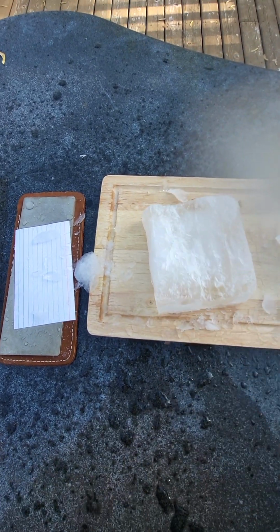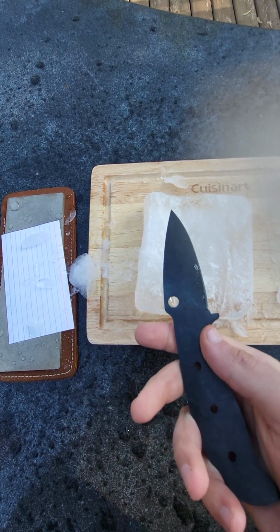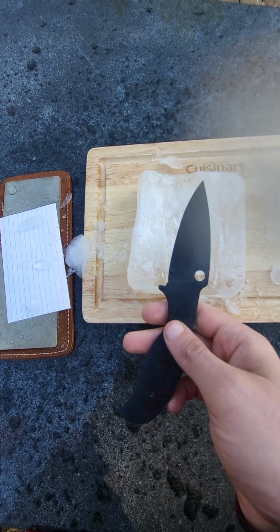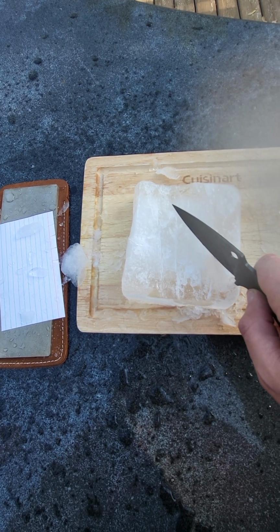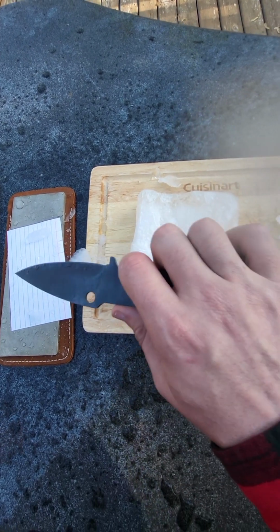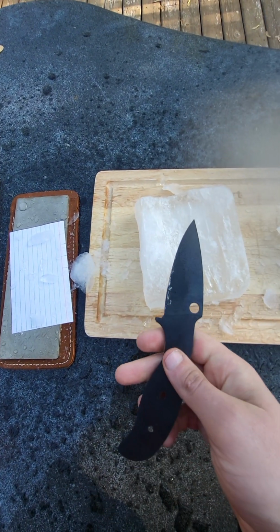Now, like I said, this knife was dull, or dull to testing standards. So right now I'm just trying to actually beat this up a little bit. Then I could go to something harder. I got plenty of rock that I could actually hit it with. But what I noticed with other testing is impacts on the ice blunt the edge, so I don't need to take it to harder material. I already found out how tough this steel actually is in relation to what it could actually do on draw cutting, at least at an 800 grit CBN Spyderco bench stone.